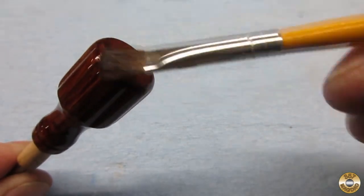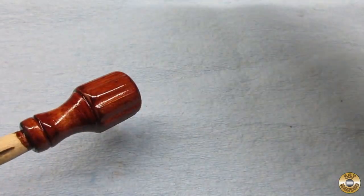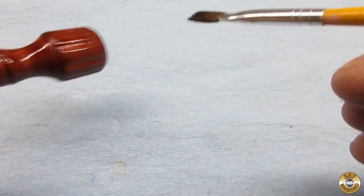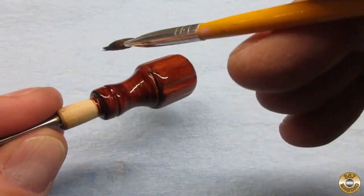Even with a light coat I find that the finish can be blotchy. I use a wet brush with no extra paint on it to very lightly even out the paint — I'm not adding any finish, I'm just trying to even out what's already on the handle. I repeatedly wipe my brush to remove excess finish.